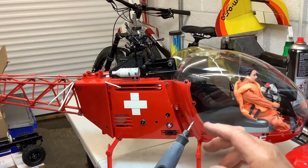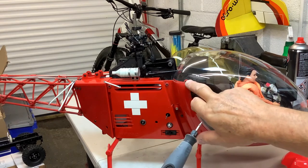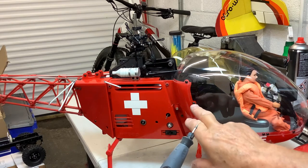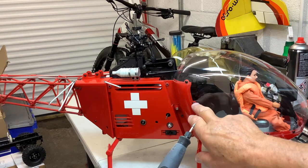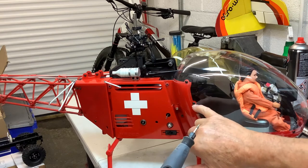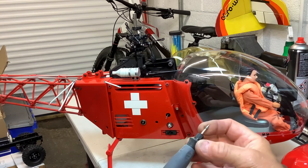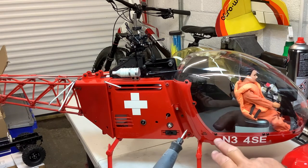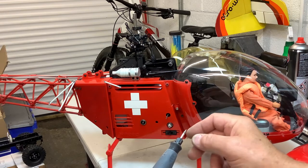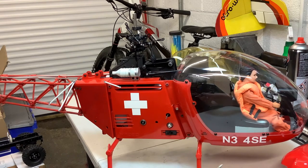You want a diamond drill, or failing that drill a very small hole and use a needle file to open it up. If you try and drill it with a normal drill, after a couple of flights you'll get little cracks because where you drilled it, it cracks around the glass. Eventually it starts starring. With the diamond tip it just went through them lovely. The holes are for 2.5mm self-tap screws with a pan head, so drill roughly 3mm to give a little leeway.